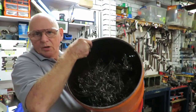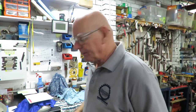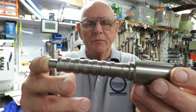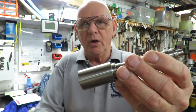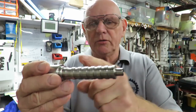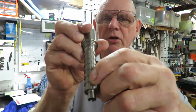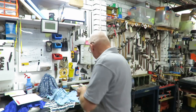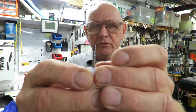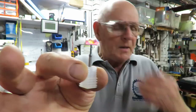We're featuring those and asking for expressions of interest. Right beside me on the floor is a 22-gallon drum of titanium swarf, and that comes from the first thing we're going to feature here. It's the first time I've ever machined anything in titanium, and that was quite a challenge. This one here has got a hole drilled through it, grooves, and two slots that go down the length. Those slots were made with a two-millimetre diameter four-flute cutter.